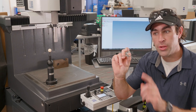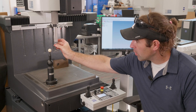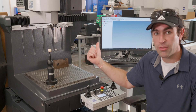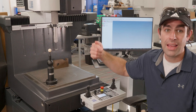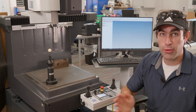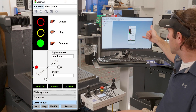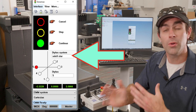I've got a stylus system here with four styli. The way it works when we put it in the machine: number five is X-negative left, number three is X-positive right, number two is Y-positive to the back, and number four is Y-negative to the front. If you forget, no big deal — it's right on the stoplight of your control screen. Just below the stoplight it'll have a graphical representation of what you need to know when you're punching these in.